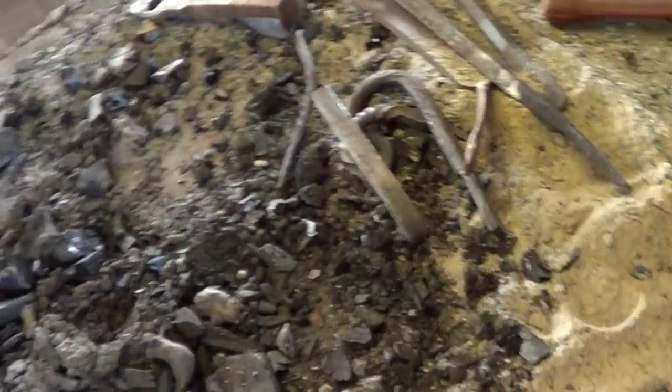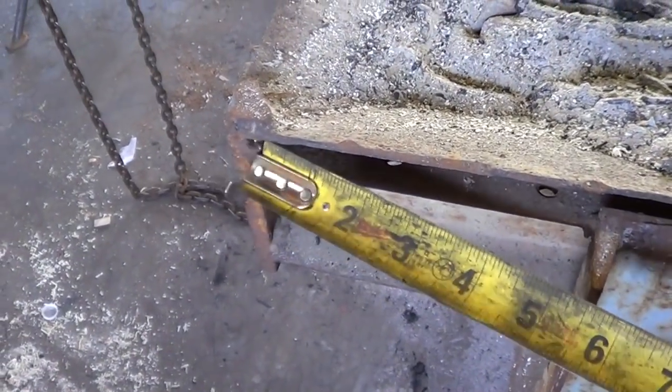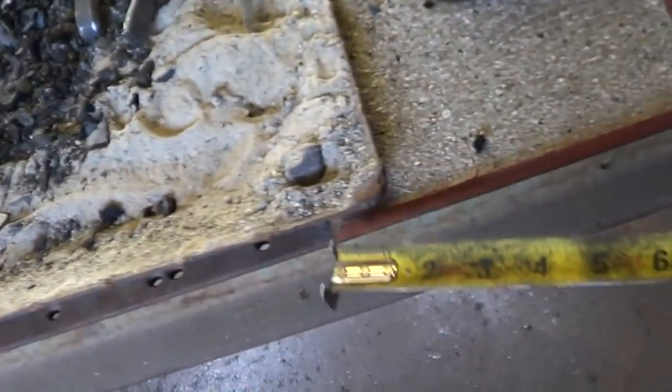I've already measured it. It's going to be roughly 30, and the width on this works out to about 28 and a half inches or so. It actually works out, just by pure chance and convenience, to fit between that little tab there and this bit of wood here. So we're just going to take advantage of that convenience, and cut this thing off to 29 and 3/4, and then we're going to cut some 3-inch strips.